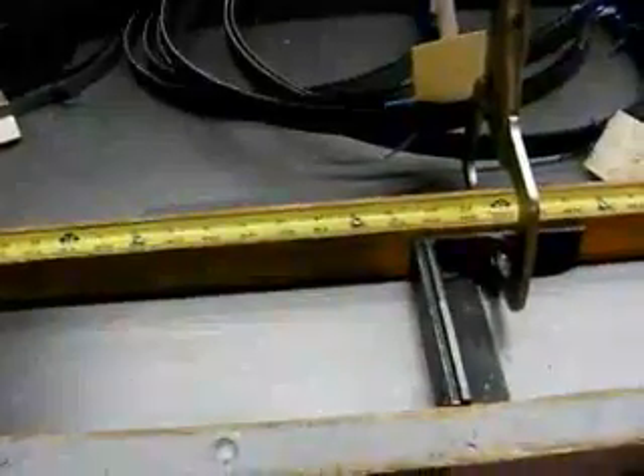From there, these boxes are brought over here to the cutoff center. Here you see a box in the bend, ready to be pulled out and cut. This is a shear — an air-over hydraulic shear. The blades come out here and will be pulled along this tray to a stop. The stop is a quarter of an inch longer than the blade needs to be. That quarter of an inch is taken up when the welder welds the blade and forces it together, which actually strengthens it.